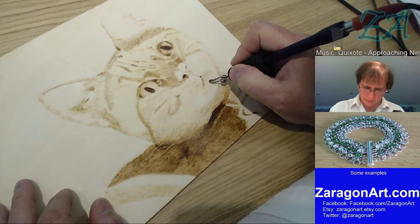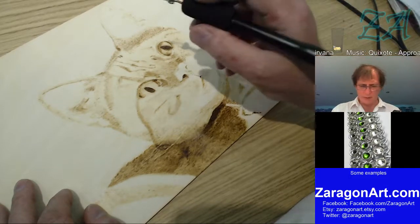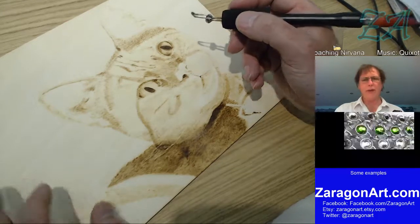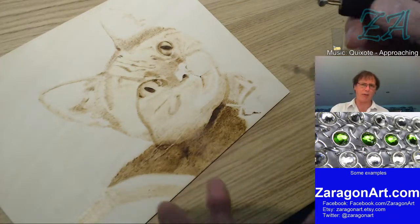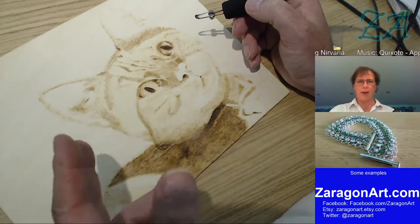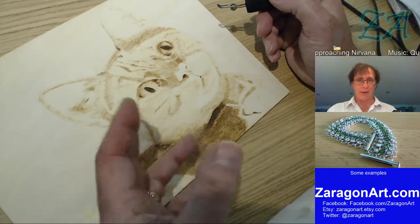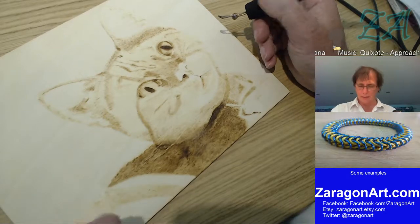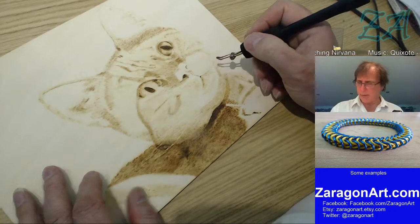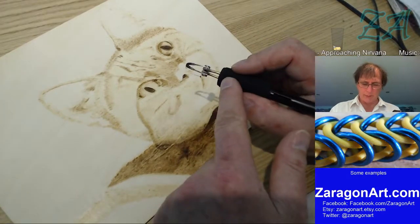The electricity, whilst they plug into the mains, this is running, I think it's about 2.5 to 3 volts, so less than a couple of, or is it 1.5? The range anyway on these tools is from about 1.5 to about 3-4 volts. That in itself is about the same as anywhere from 1 to about 3 AAA cells, AA cells, just your standard single-use batteries. And the control unit is reducing the mains down to that sort of level. So this is in itself safe to touch.